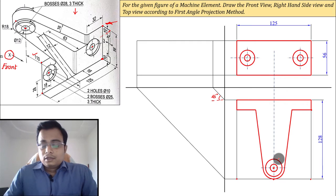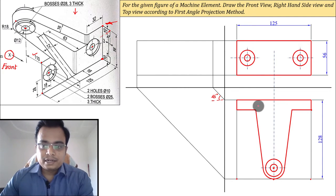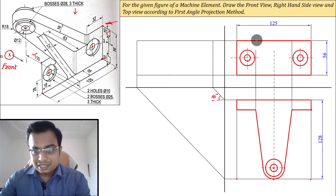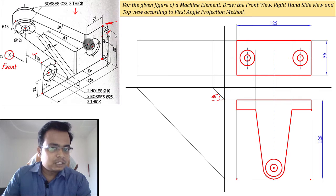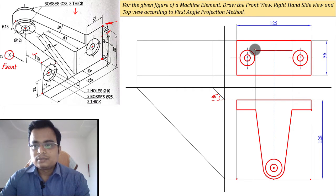Some parts of the top view and front view are still left. In the front view, this portion is 16 millimeters below — so travel 16 downward along this line. This curved portion will appear as a straight line from the front between these two points. The distance from here to here is 16 millimeters below, and the line is drawn between those two points.